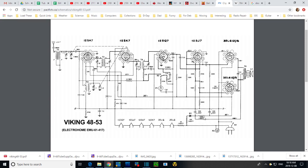So typically in a radio like this you have a better filtered output right here. Yeah, I like that. It's going to the output tubes. Okay, and the less filtered is going, oh, I'll take that back. No. This filtered is going to the plates. Know what they're going to? It's going to the screen here. Is that a screen? What kind of tubes are these? Screen. Okay, and the less filtered is going to the output transformer and the plates. Okay, that's normal. And this better filtered B plus is then extending back through the radio, getting all the plates of these tubes.